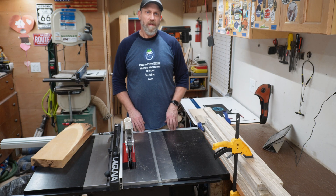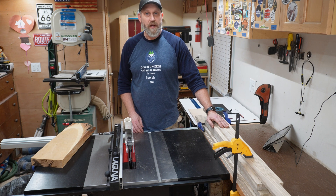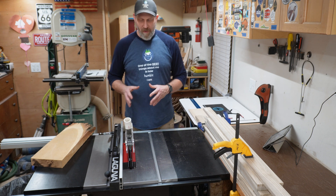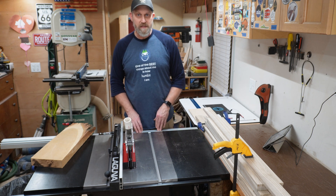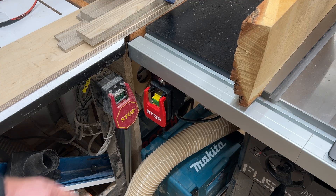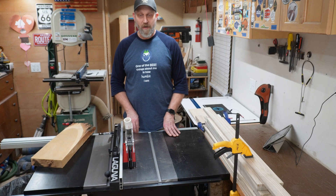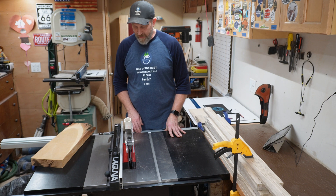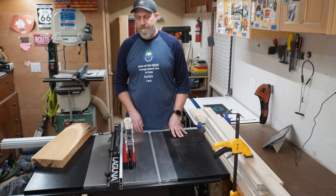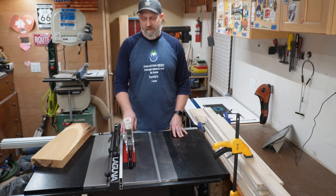In the project I'm currently working on — some picture frames for canvas art — I've been cutting down some reclaimed white oak that's got some really nice weathered color. It's tough stuff, and it's not always straight when running it through the saw. Sometimes internal tension will put a bind on the blade. The reset button kept popping off and several times the saw quit spinning in the middle of a cut. I'm hoping that 220 will make it more powerful and it won't bog down as easily. I was also using a full kerf ripping blade that was pretty dirty, so that didn't help.